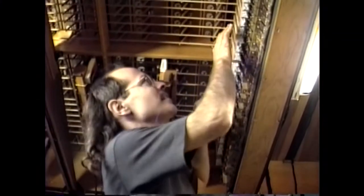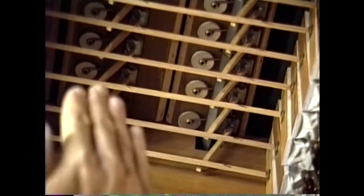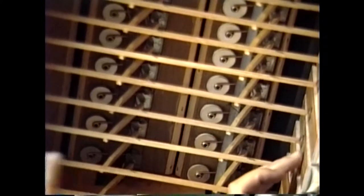When the manual motors — if the organist has no stops drawn and plays on the keys, the pouches will just collapse under the wind pressure. If a stop is drawn, there's a similar action on the other side going perpendicular to this set. When the organist draws a stop, another pneumatic — which we call a stop action — pulls this armature over and changes the fulcrum on that shifting jack. Then you can see a valve is opening for this stop. So when the stop is off, no valves play. If she draws one stop and plays a key, then that note for that stop will play.